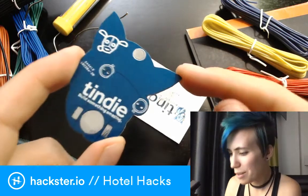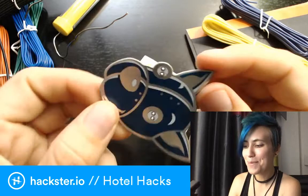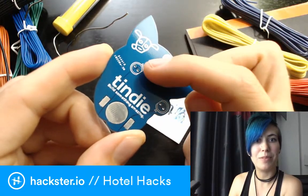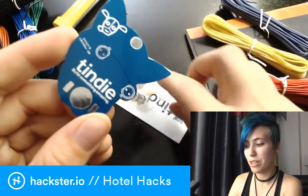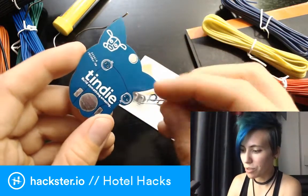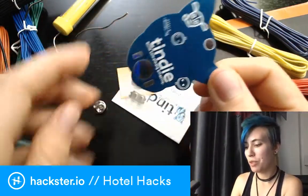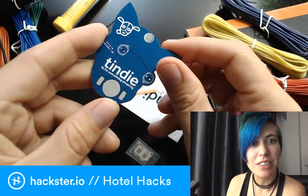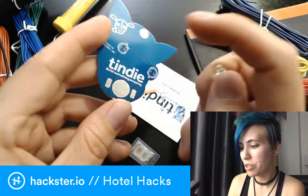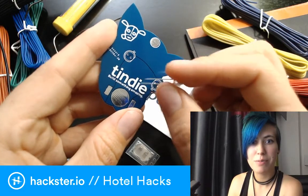I'm going to see if I can do this without the instructions. It seems pretty straightforward. There's a place for the pin backing and two LEDs. The negative side usually has a flat side, but these ones don't — they do have a shorter leg though, which corresponds to the negative side. There's also a place for the battery holder, and you can see the traces on the PCB — the power part and the center part which is ground. These little flat guys in the center are attached to the big pad on the PCB.